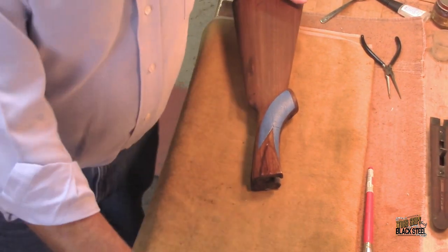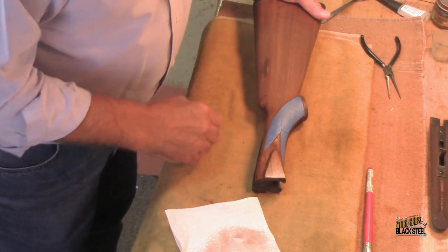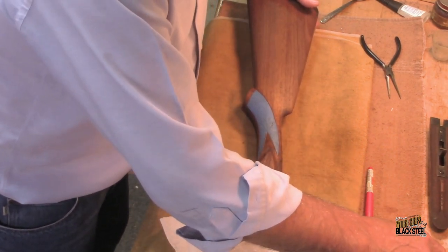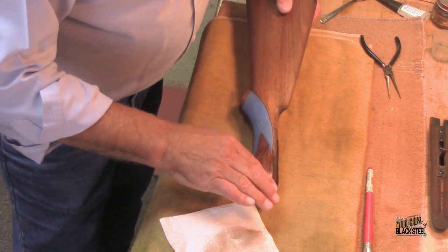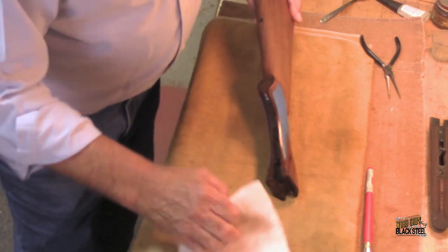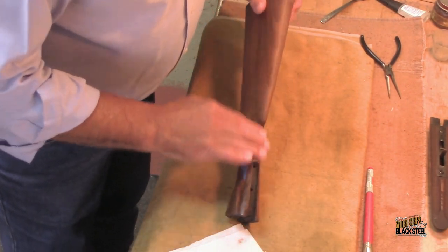Whenever you're doing any kind of coloring, unless you're spraying stain or something along those lines, which I'm not doing, you don't try to go for the whole color all at once. You try to build it in layer by layer. I was taught this by probably one of the best in the business. You've actually met him on this channel before. And that darkens it really nice, gives it a nice rich tone. Because we're not up in the back of this thing yet.